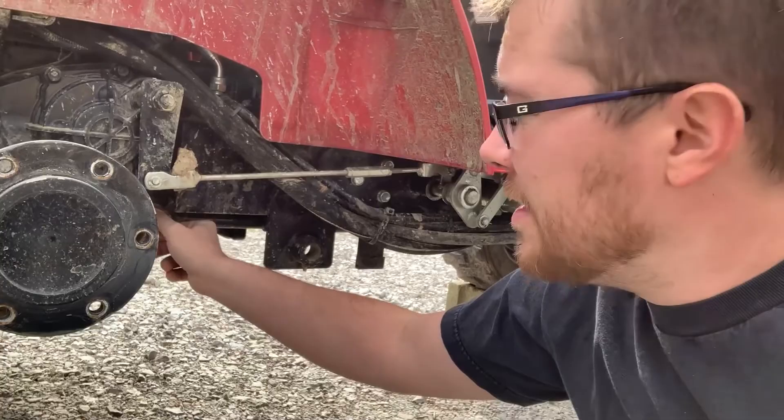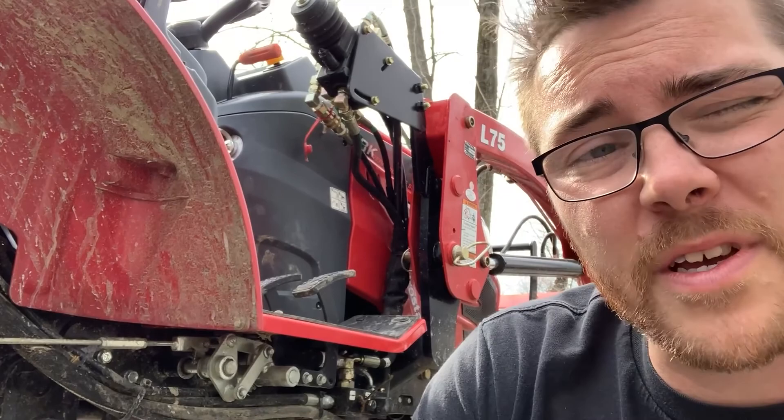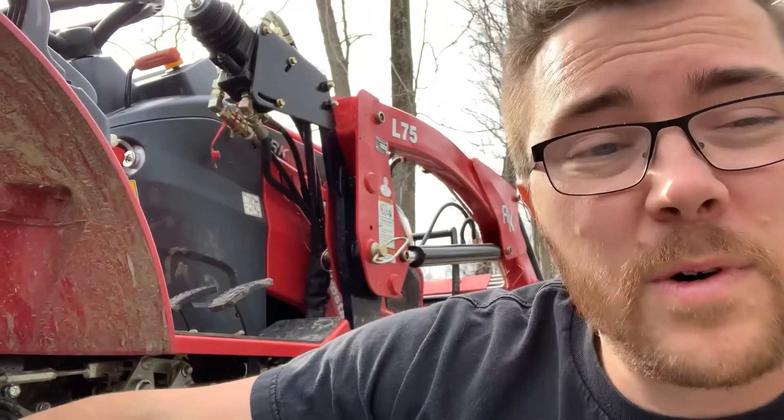When it's just here at the beginning at the 50 hours, a lot of people are saying you take it out and it'll look clean. If it is, just take some diesel fuel to it, clean it, make sure there's no particulates there, blow it off with some air, throw it back in, it's good to go. So if you break that off, that is actually the most expensive part to this whole process — it's $50 for that one little filter, so try your best not to break it.